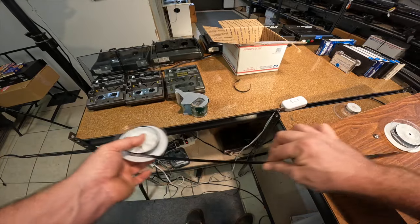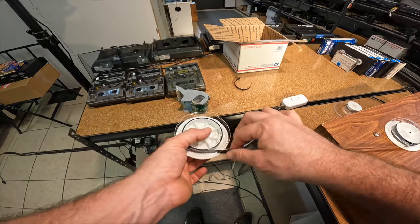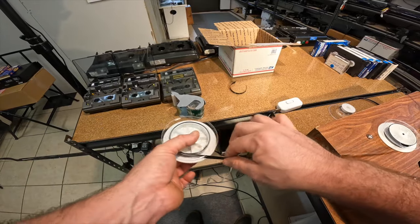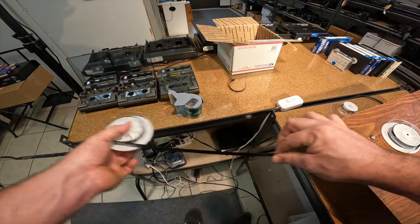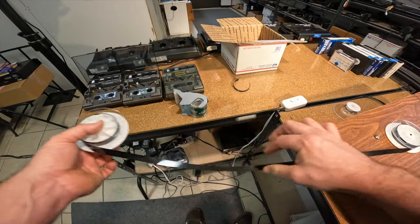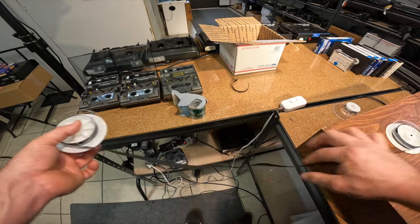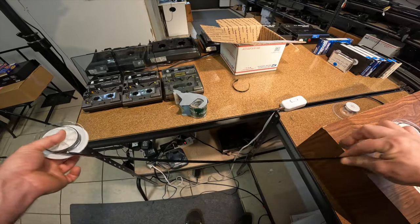This is just preparing us for capturing it. Hopefully we won't run into any issues, but a lot of the time if it's actually sticky shedding like this, we end up having issues where it dirties up the VCR heads. Luckily this isn't a Hi8, Digital 8, or Mini DV tape, because those are much harder to transfer with sticky shed. VHS tape is pretty straightforward — a pretty easy process, especially if you have a rewinder you can put a dimmer on. This is an incredible secret I'm giving away here — like and subscribe.